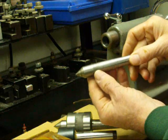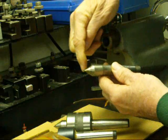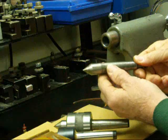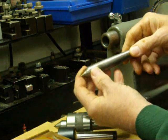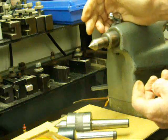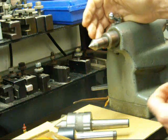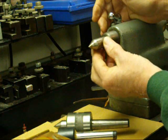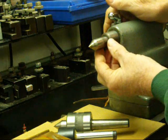These are really the same, only smaller. This is a dead center, and these are always 60 degrees — that's why our center drills are 60 degrees. Always wipe these off and clean everything. If it's going to be in there for a long time, always put a light coat of oil on it, because sometimes in industry a center may be left in a lathe tailstock for years. You want to make sure it doesn't get seized. I'm putting these in gently now, but if you're going to use them, you tap them in lightly with a lead hammer.